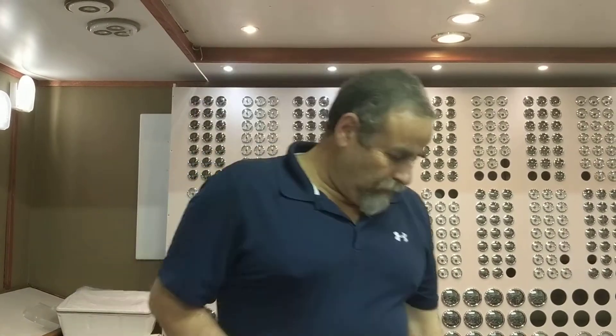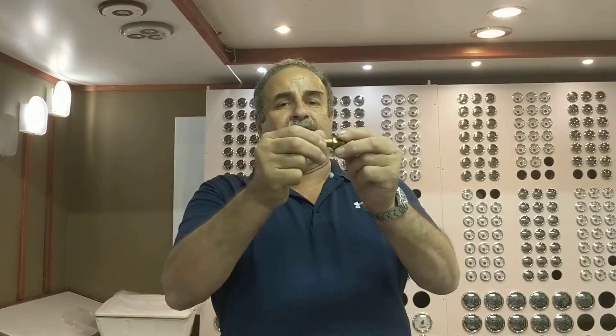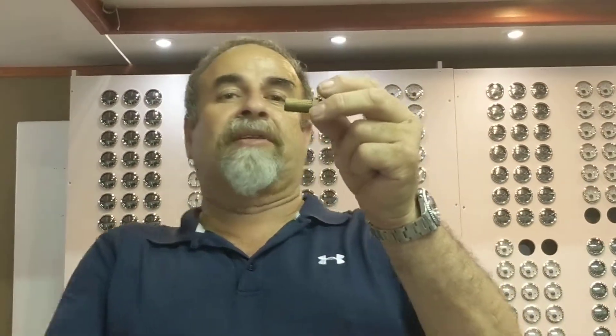For other engines like some three-cylinder GM YM models, they usually have another port, but boat owners typically use that second port to add plumbing for a water heater. The plumbing system uses that port — there's a port coming out of the engine and one going in. The outlet goes to the water heater, comes back from the water heater, and goes back into the engine to warm up the system.